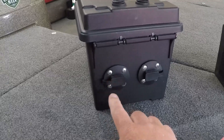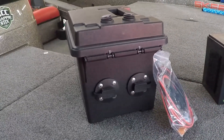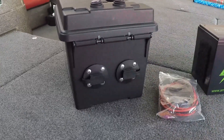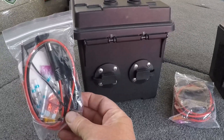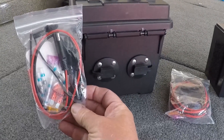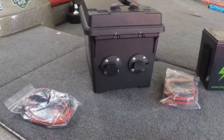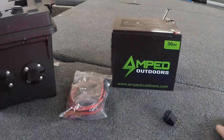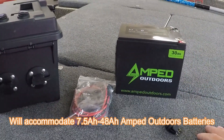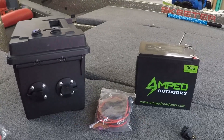What's neat about this box is there are two separate SAE ports — that's why there are two different power plugs. One of them you can wire directly to your black box, and the other one you can wire directly to the power cord coming off of your unit. That way there's no guesswork about how you need to splice the power cords together — each one will have its own separate power cord. You can decide what size battery you'll use; this box is designed for the 30 Ah battery to fit perfectly, but other sizes are available depending on your amp-hour needs.